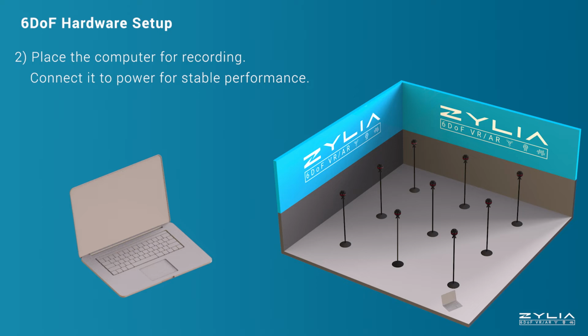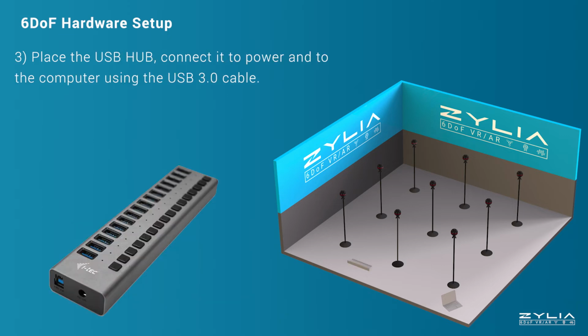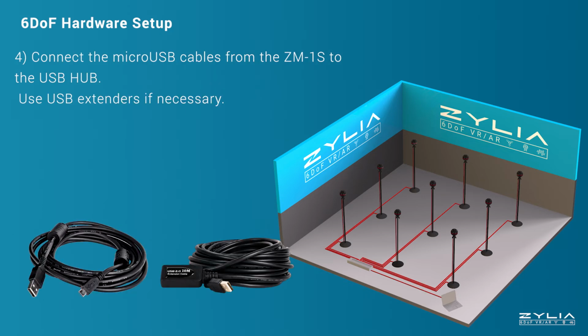The second step is to connect your computer to a power supply and place it on an accessible spot for the cable connections and also for the operator. Place the USB hub between the computer and the microphone arrays. You may connect it to the computer with the USB cable and to the power supply. Connect the micro USB cable to the ZM1S arrays and the USB hub. Use the additional USB active extenders if necessary.